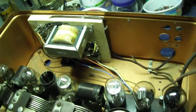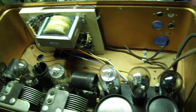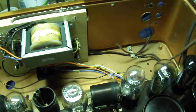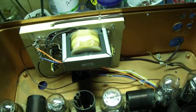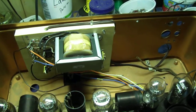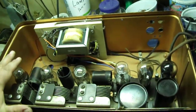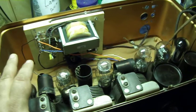I thought I'd show this off tonight because I know there are a lot of these radios out there. Shops want three, four, five hundred dollars to go through a power pack for one of these things — and it doesn't sound any better than what it does now. I had this thing working on AC, but the power pack had bad filters I couldn't get to. The voltage across the chokes finally cooked it — it got quiet one day and burned up. So I decided I'm not going to spend all that money. You can buy the whole radio working, like brand new, at radio shows for less than a hundred bucks. They're not a really rare radio.